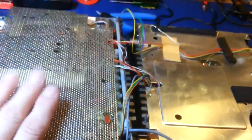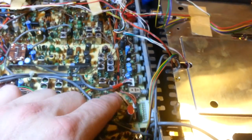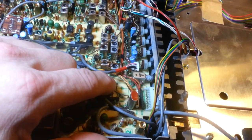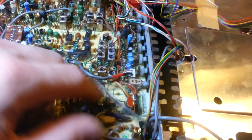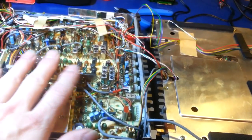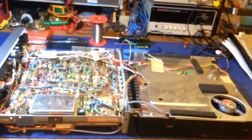So like I say, it's not the proper way. The proper way, of course, would be the hard way, which is to take out the entire board. But like I say, in a lot of cases, this just makes it easier to service in the future. As long as you properly, when you put your wires on there, make sure you slide a little piece of heat shrink tubing over, so these tabs can't short out against anything. But you're basically just using those as terminal tie points. So like I say, it just eliminates the hassle of having to disconnect all of this and remove this entire board up out of the unit, so you can desolder those two pins. So there's just a quick little tip on replacing your memory battery.